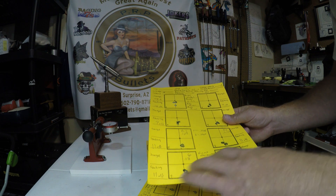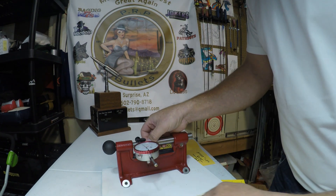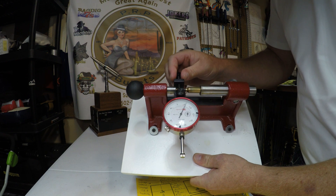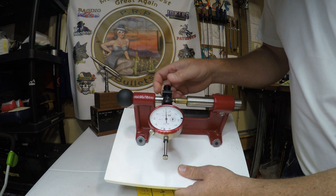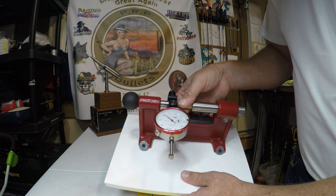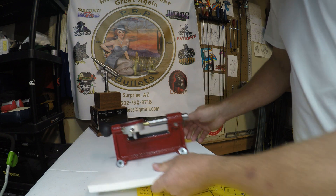Then I had to sort of create the runout. Using this Hornady tool, you can create runout by throwing a bullet in there. It looks like there's about less than a thousandth runout in this bullet. You can use this little tool to actually create runout — you kind of turn it and create a little runout. Turning it further can actually eliminate runout. This one is going to create a lot of runout because I just gave it a good tug — looks like five, ten, eleven, twelve thousandths runout — which is too much. I would normally then sort of re-center the bullet to get about six thousandths runout, because I figured six thousandths is probably the maximum that your tooling is going to get.